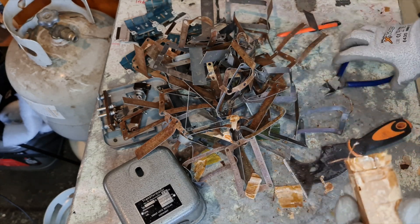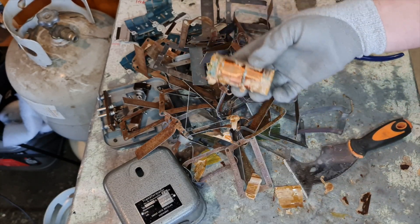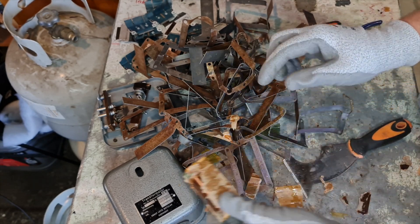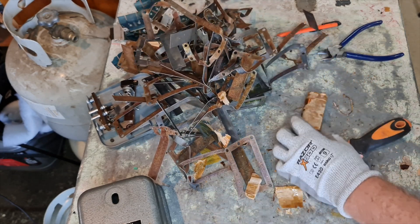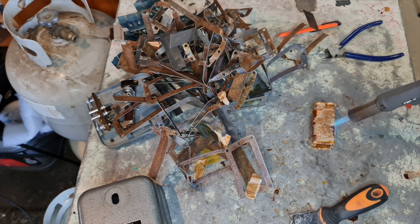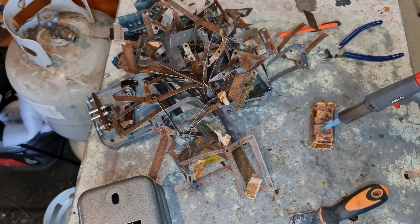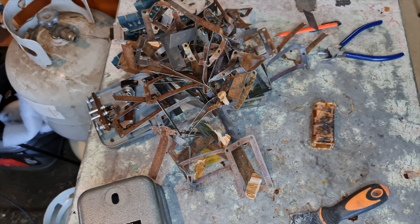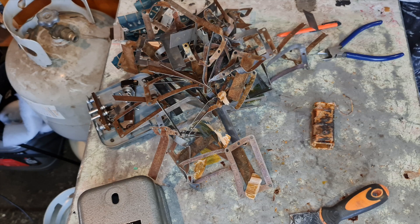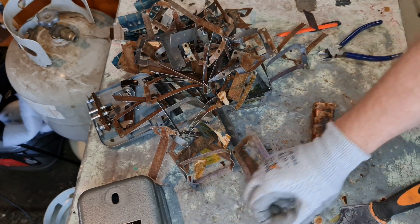That's what I'll do guys - I will use my blowtorch and incinerate this simply by heating it up. I'll just heat it up like this until it catches fire, turns to carbon, and then I'll smash it with a hammer a little bit and just go around the whole thing. When it gets to a point where I'm happy with it, I'll just throw it in my crucible and then I'll worry about the rest of it - all the carbon and everything - when I do my melts.